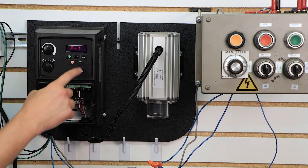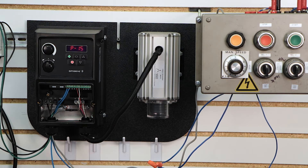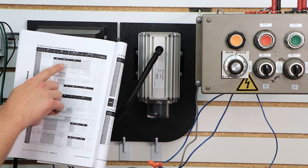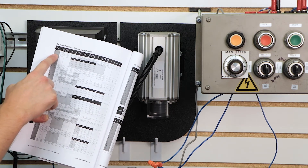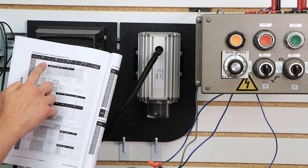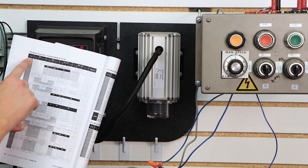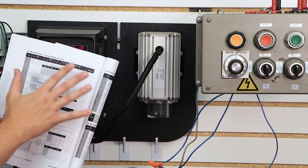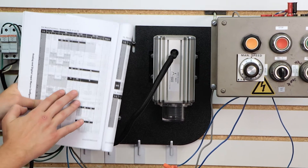Once you've set 201, press the menu button again, and then we can go up to P15. P15 is actually our macro selection. There are a whole bunch of different macros we can set — the P15 value is on the left, so we can do 0, 1, 2, 3. For this video, we're going to be setting digital input 1 to our run command, and we are going to have our analog input A1 set up as our speed. So we're just going to leave P15 at 0, which is the default macro the drive ships with. If you want to do something more unique, you can go through all of these macros and choose one that best fits your application.